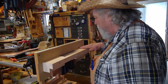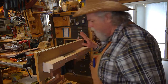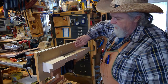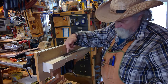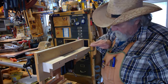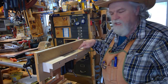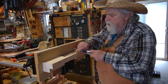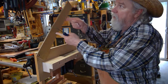I cut down the edges on the inside ends of the two boards so the plane sits in here nice and flat and level. The table is true all the way across. To make it work, I added a quarter-inch hardboard on top of the plane so the blade is underneath the board, allowing it to shave all the way to the edge. To remove the plane, I just take out three of the four screws holding that piece.